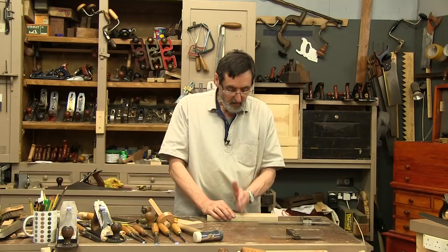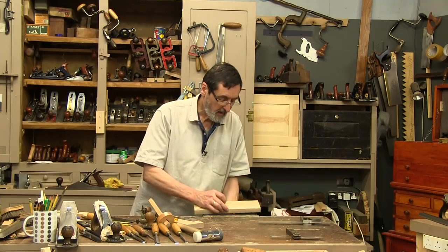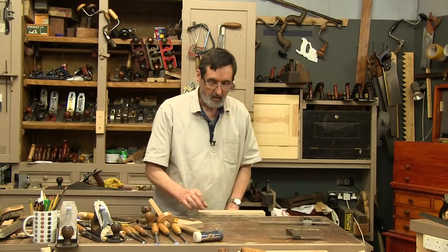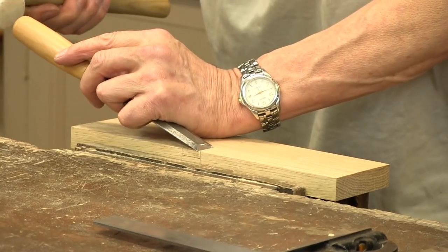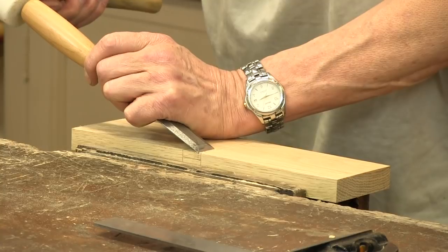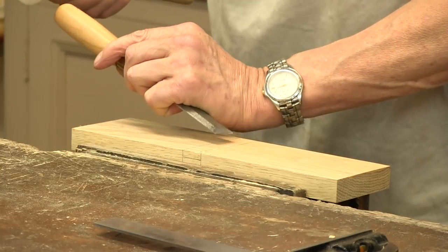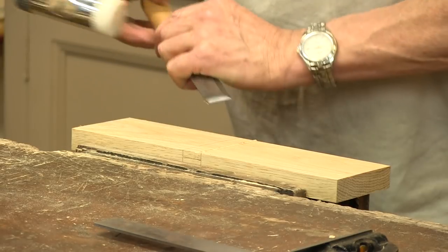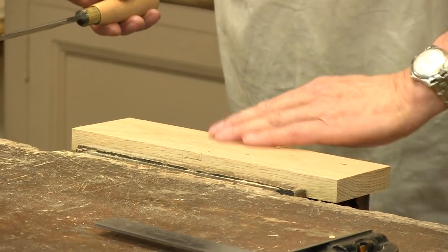The reason I'm leaving the second line alone is that when I'm cutting this one I can move the knife wall over slightly — it may just be a hair, but it may be enough to make a variance that will show in the finished joint. I go into my vise, well secured, with a one-inch wide chisel, then into the knife wall here, angling my chisel upwards about four millimeters — about one-eighth of an inch — from the line. I overlap the start point on my chisel and flick the waste out of the way just to make the recess definitive.